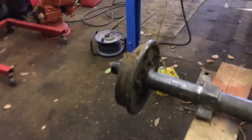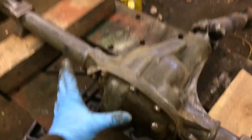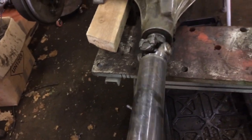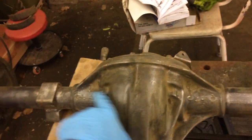Anyhow, you need to change these every now and then. Now, to change the shoes on this vehicle, you need to take the half shaft out, which is really weird, but 1942, right? It's called a half shaft because you have one on this side and one on this side, coming onto the diff, which has a series of cogs and splines in it, and that makes the wheel turn. When you turn this power shaft, that makes this mechanism turn inside and distribute this turning into that half shaft and that one. And that's what makes the wheels turn.